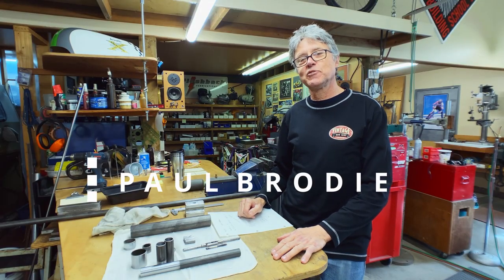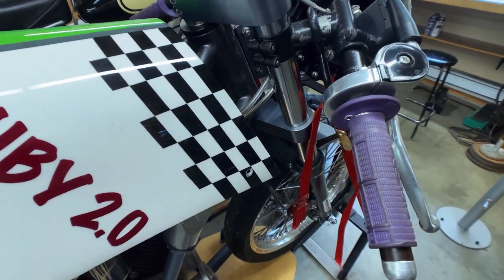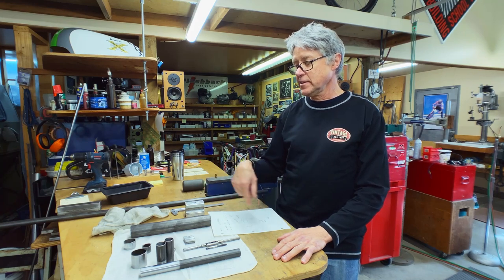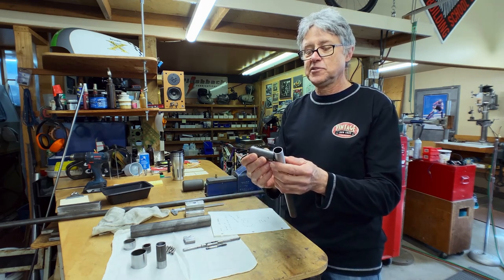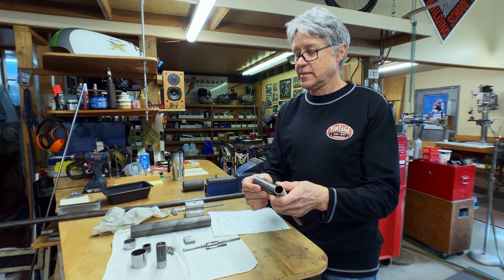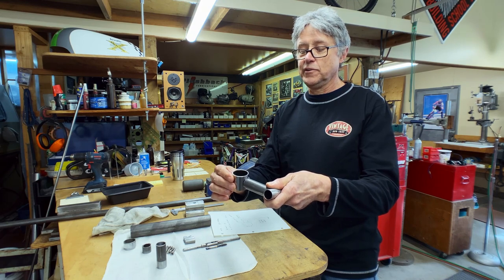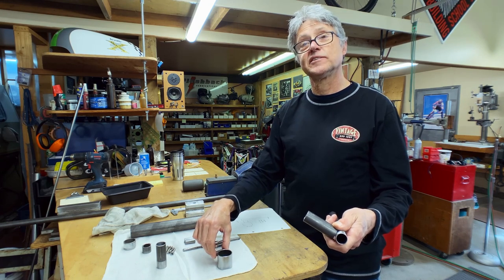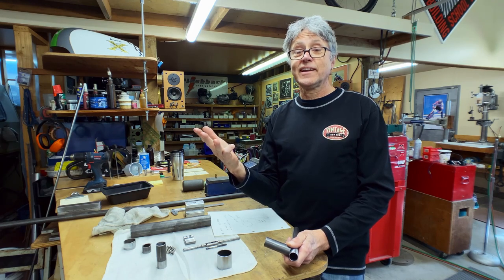Hi, I'm Paul Brody. I'm here with Mitch behind the camera, and this is my shop. Today we're making a pair of clip-on handlebars for my little Aramaki racer. I've got a bunch of chromoly steel here that's going to get welded onto this tube. The tube first has to be ovalized in the arbor press, then it gets bolted and welded onto the clamp tube at an angle of 10 degrees. Then there are the pinch lugs, which get brazed on. We're going to use a hacksaw, a lathe, a milling machine, and an oxy-acetylene welder.